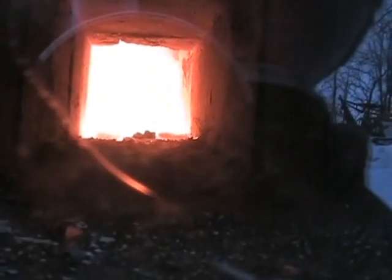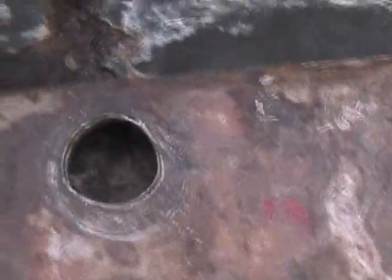There you go — glass is a little bit cleaner now. Yeah, I can see what's going on inside there. From where the jet drops down, all the way to the back of the boiler tube, she's bumping out a lot of heat. You can see a couple chunks of steel down there, a little red glow. The stove works on negative pressure. I put a little bit of an air gap right about there — you can see it. I need that bolt out so that this window stays relatively clear because I've got a little stream of cool air going through it.